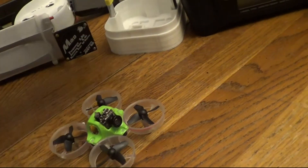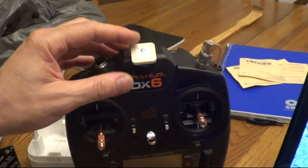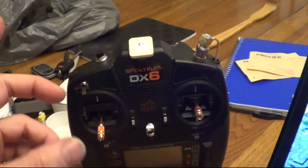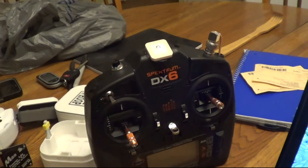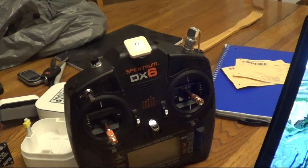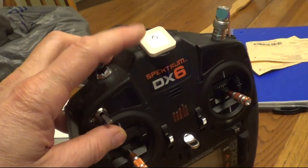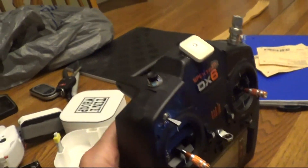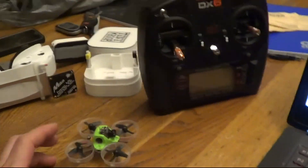I tested the 200 milliwatt camera and it was a piece of junk, so these are good cameras. For the uplink you can use as much power as you want — not legal though. This uplink is 1300 milliwatts at 2.4 GHz, so there's no problem with fail-safing. I have a video on that and there are easier ways to do the mods — tons of videos on raising power on your transmitter.